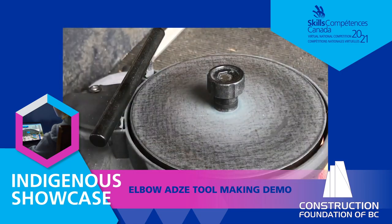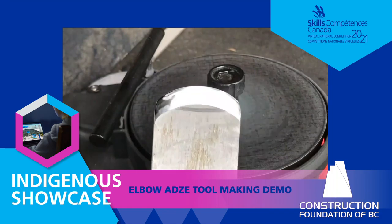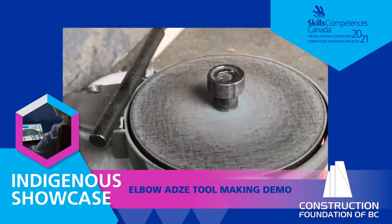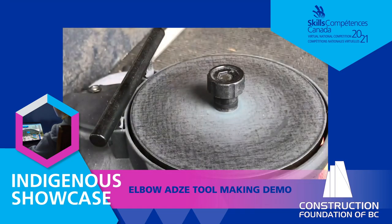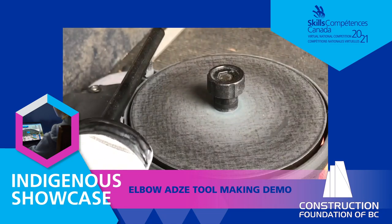After the diamond stones, we're going to use some emery paper. I have a Work Sharp sharpener — it's quite a miraculous machine because I have lots of tools that need honing while I'm carving. It's really good for finishing off blades, whether it's the bent knives we make or this adze blade we're fashioning. You can see it's pretty much to a nice shine. I'm thinking about putting the temper back into it — I'll probably just test it out to see how it cuts. Make sure your sleeves are rolled up and safety goggles are on.